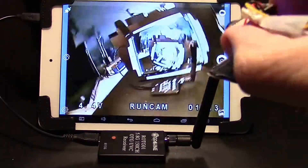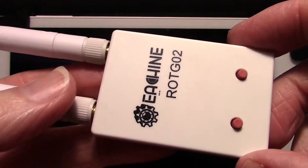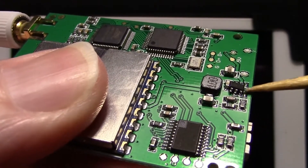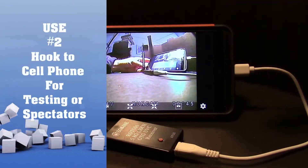The latency doesn't seem to be too bad. Unfortunately with the diversity receiver, I think I got a lemon, because this chip right here looks like it's up on top of that resistor and not soldered onto the two pads. It looks like this one's a bust, but let's continue on with the other one.